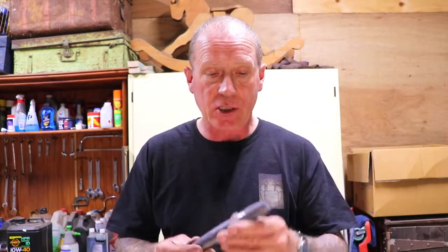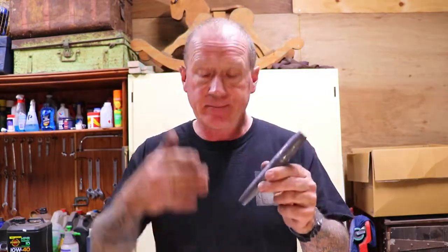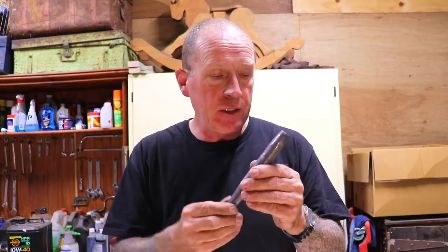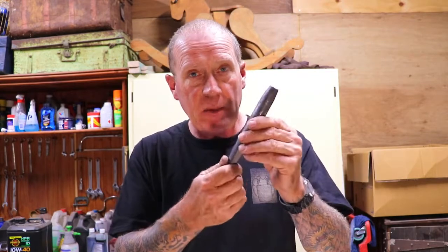And I think that's what it's all about, YouTube, blacksmiths, spreading out that knowledge, letting everybody know what's happening, so that other people can have a go at it. So drifts are a fundamental blacksmith's tool that everybody needs. You saw a bit of footage there of me drifting out that piece of hot flat bar out to ½ inch. I would encourage everybody to make them. These are a fundamental blacksmith's tool.